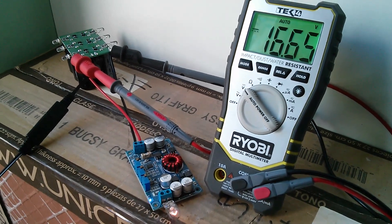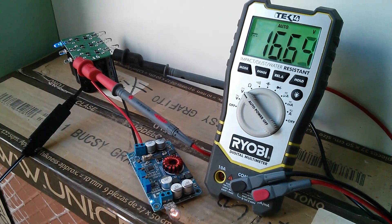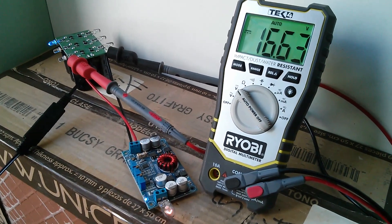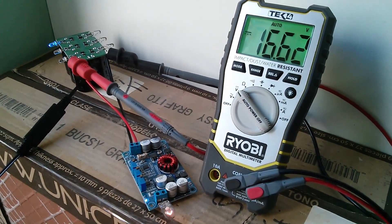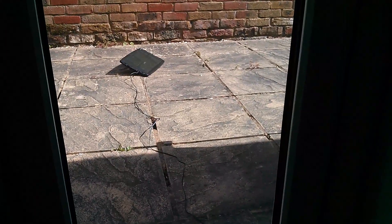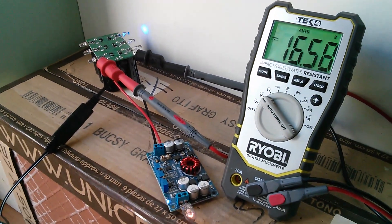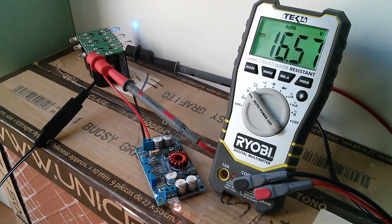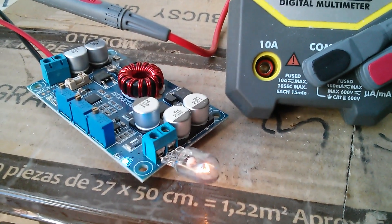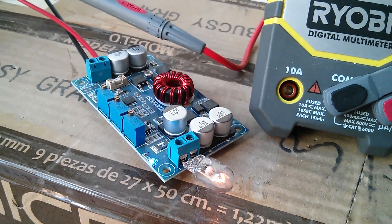This is great fun — a little supercapacitor power system, power bank. We've got one of the blue LEDs come on now, so the supercapacitor voltage is falling. Not much of a lamp admittedly, but if I scale this whole system up with a bigger solar panel and more of these supercapacitor banks, then I could have more stored power and the ability to draw more power out from the buck boost converter and drive a bigger load than that 100 milliamp bulb.